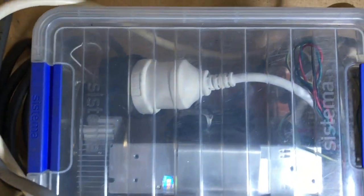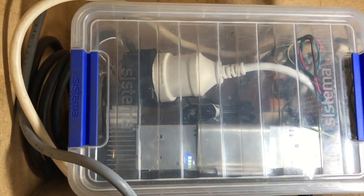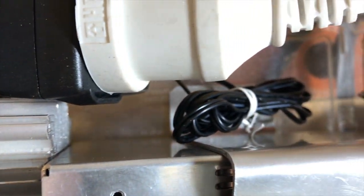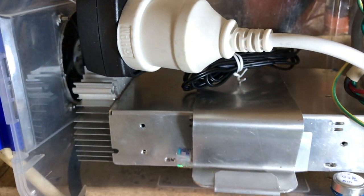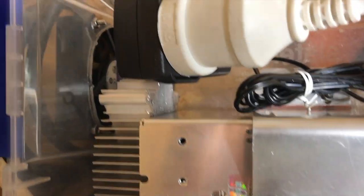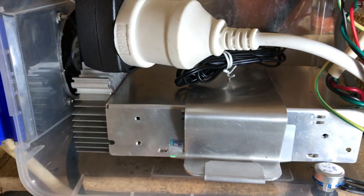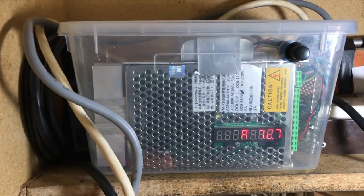When the circuitry arrived from China, I put it in this plastic box with a knob on the front. I thought it might get a little hot inside the box, so I put a computer fan in there. It requires its own little transformer power supply to provide 12 volts, through that white plug. I also put cooling fins on the circuit — it already had a small cooling fin arrangement inside, but I added this bigger set. It never gets really warm actually, so it's probably overkill. The whole thing sits flat in the box and works fine. The only thing is the fan is very noisy and probably superfluous, so I intend to put a diode or resistor in the circuit to slow it down and make it quieter. I've also changed the pulley on the motor over to the slower-speed one, so it'll run at about half the RPM.